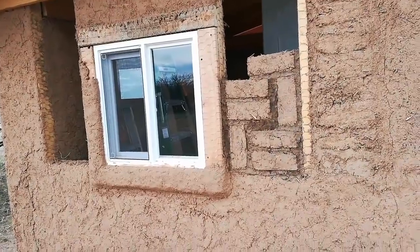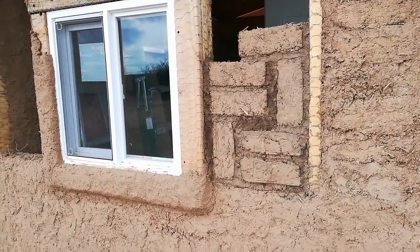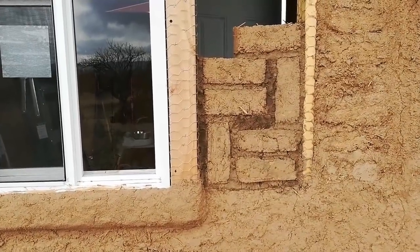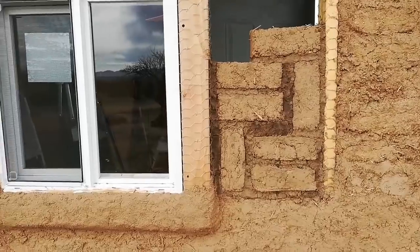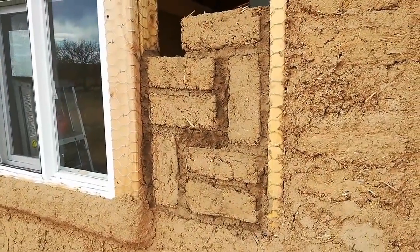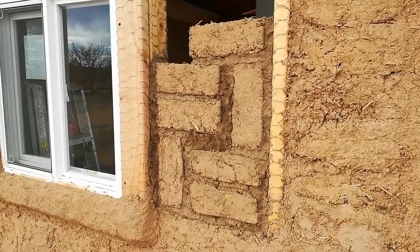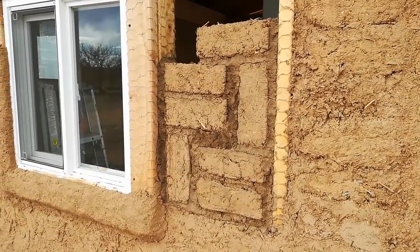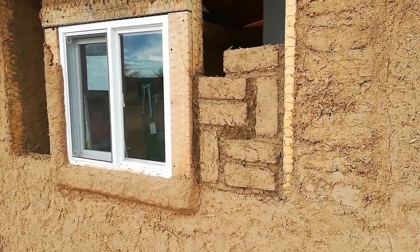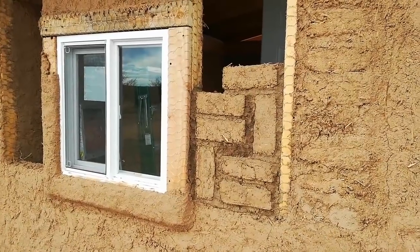So here we are the next day, and I can see a little bit of a difference in the tonality of the mortar as opposed to the brick. I can also tell that it's not 100% dry yet, but there was a little bit of difference in tone. So I think our next experiment is going to be not using ground up charcoal, because quite frankly, that's just going to be inconsistent and add a lot of labor to the process. I'm thinking of trying either some black paint or, believe it or not, some black printer ink from my 3880 Epson printer, which is a large format printer. I have very large cartridges of black ink and refill bottles of black ink, just to see what happens. Might as well give it a shot. I've got it available, so I'm going to do that and I'll show you the results.